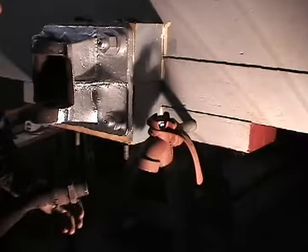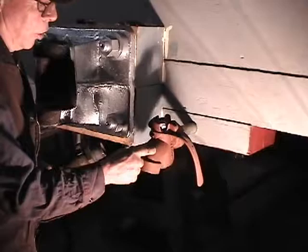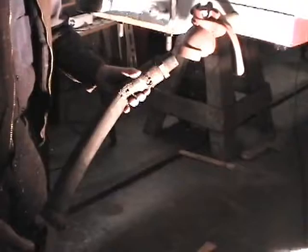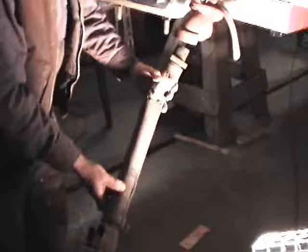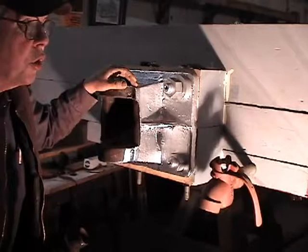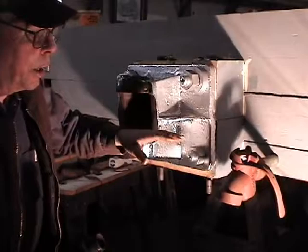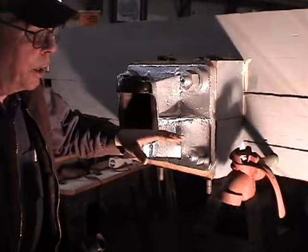This is the end of the train line, where it will couple onto another car. When the locomotive is running by itself, the valve is shut off and no air can come out here. When you couple onto a train, you have a hose with what they call a glad hand on the end, and the next car has a similar one that couples to that — this is what helps give you brakes in all the cars. If you were pulling a number of heavy cars without brakes in every car, going up or down any kind of grade and trying to stop, they could just slide the locomotive right along, because it doesn't have the weight some locomotives might.